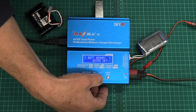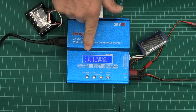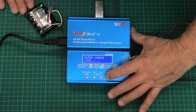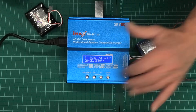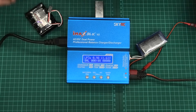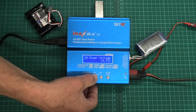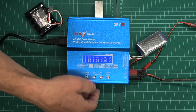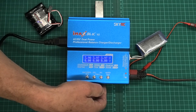Let me go back into the 3-cell LiPo setting. The battery is connected up and we'll charge it — hold the button down and there we go, now it's charging. You can see how long it's been charging and the current it's putting in. You can toggle through and it will show a number of settings, including temperature and the charge of the individual cells — it will tell you how full they are and what the cell voltage is, as well as the overall voltage.